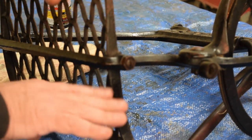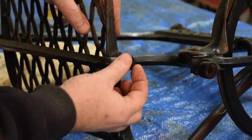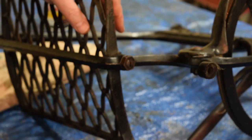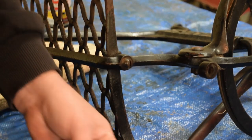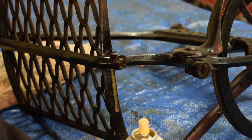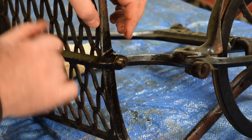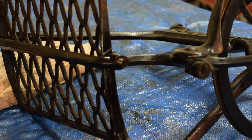This is the treadle itself, the foot treadle, and it's held on with this nut here, and it has a slotted screw in it. That screw is actually tapered, and this allows you to adjust the tension on this treadle assembly. Now this is a 3/4 inch nut, and that acts as kind of a lock nut, and then this is that is in there. But what this is, it's a threaded bolt with a tapered shaft at the end of it that goes into here, and you can tighten this up. We've got to get this out of here, so let me start wrestling with this.